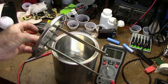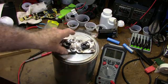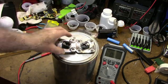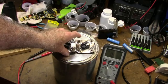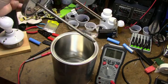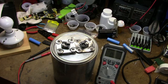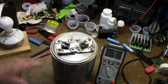It should be more than enough to handle any audio amplifier I'll ever work on. It's a design I kind of borrowed from the Heath Cantena — I have one of those from my ham radio equipment. If you look at buying resistive elements to test audio amplifiers, they can get pretty expensive. I think I got these at a secondhand store or Goodwill for just a few dollars a piece, and just out of curiosity I brought them home and measured the resistance and inductance — and I was kind of surprised. So if you work on audio amplifiers, here's another option for you.